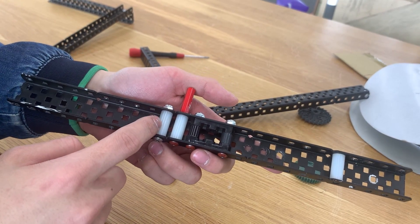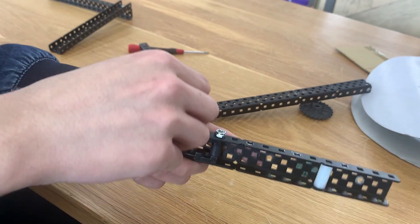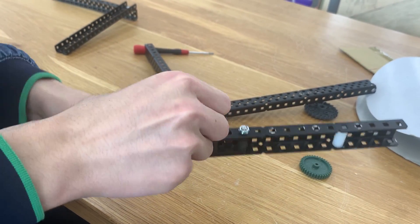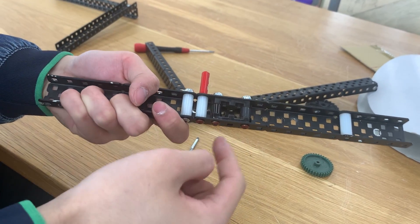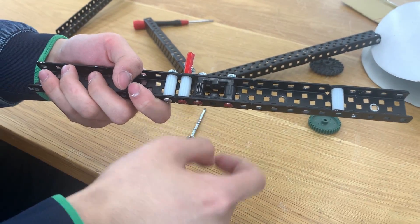You can also apply boxed bolting not just on C-channel connections but also on standoffs. If you have a really long standoff that's supporting something, instead of just having the structure twist at the flange, you can constrain the entire structure so it'll be a lot stronger.